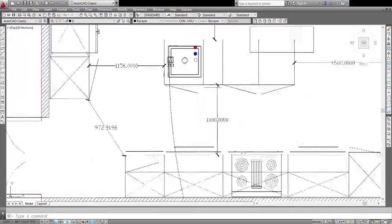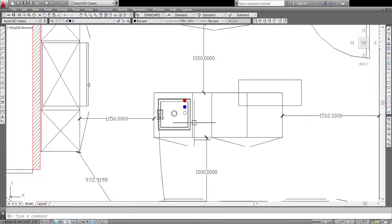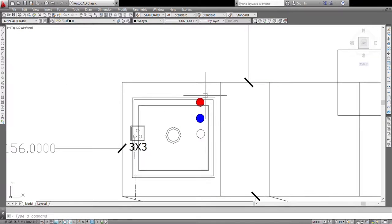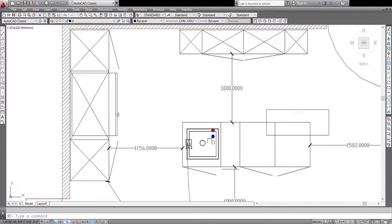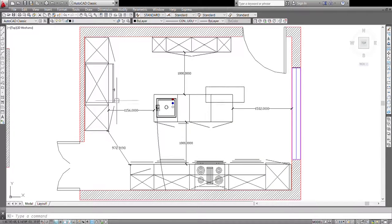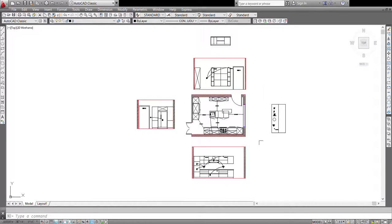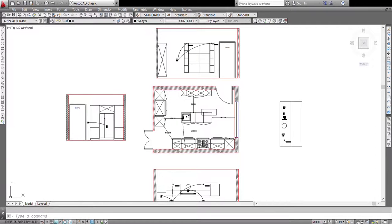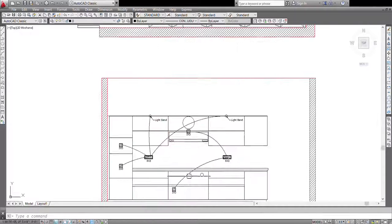The water points — the gap between all three is 3 inches, and this is the standard dimension for water points given under the counter. We don't need to worry too much about their exact dimensions because the pipes will just be coming inside. However, if you are using a sink whose tap is on the wall, always provide 6 inches of gap between the two points. That was it for today's video — we just completed the electrical and plumbing drawing of this kitchen. You can mail us your designs and we'll get back to you with the design study.